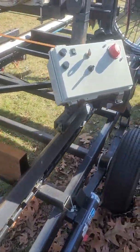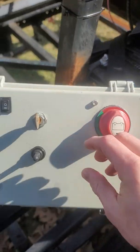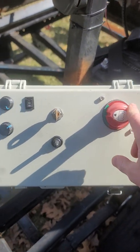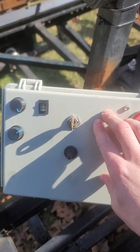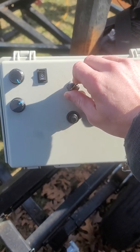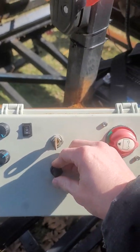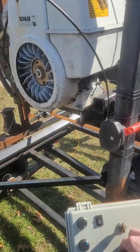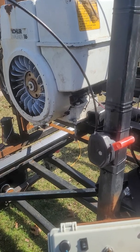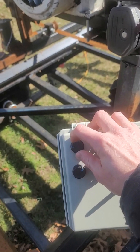I have my control panel here — just a couple of different controllers inside. The battery was dead; I had it on charge but it's still kind of dead. This is my main switch that puts power to everything inside the box, which runs two DC pulse width modulators. I can go up and down with this winch up here — that's just running a regular winch cable — so I can move the whole system up and down to change the location of where I'm sawing. And right here I can move it forward and back.